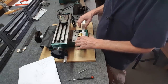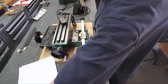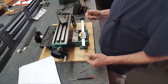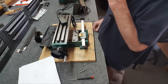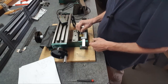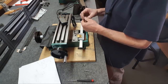This is how I did it on the other mill for the Y axis. The shim stock is about five thousandths thick — sounds really thin but it's very stiff, so it's perfect material. Just drill the holes in it, then to get it so it doesn't touch, I bent it straight up, put the gauge pin underneath for the gap, then bent it down and it lands right on it — no pressure or force at all.